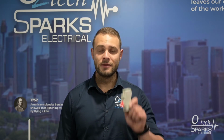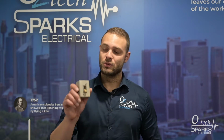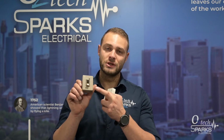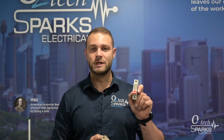Just a heads up guys, this is what a circuit breaker looks like, and this is what your main switch should look like given the current rating. This is what a circuit breaker does not look like. This is what the old main switches used to be. This does not have any overload and short circuit protection. This does have overload and short circuit protection.